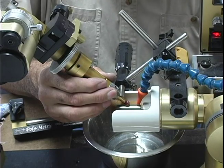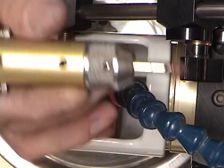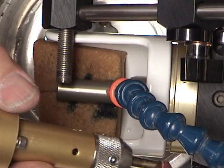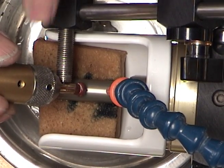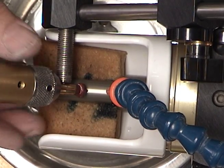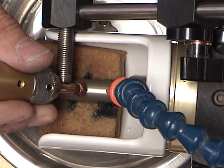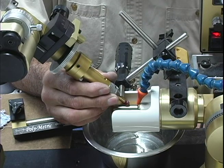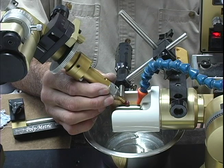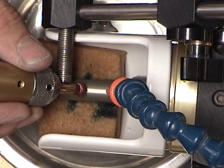The OMF machine has an oscillating motion that goes in and out. I'm going to bring it up and inspect it periodically. You need to lower the cut just a bit, bring it up against the stop, and then cut. I'm applying just ever so slight pressure, waiting for the machine — the scintillator is digital — to come right up to the 45-degree angle. You can hear the cutting action has slowed down; I've finished the cut on that facet.